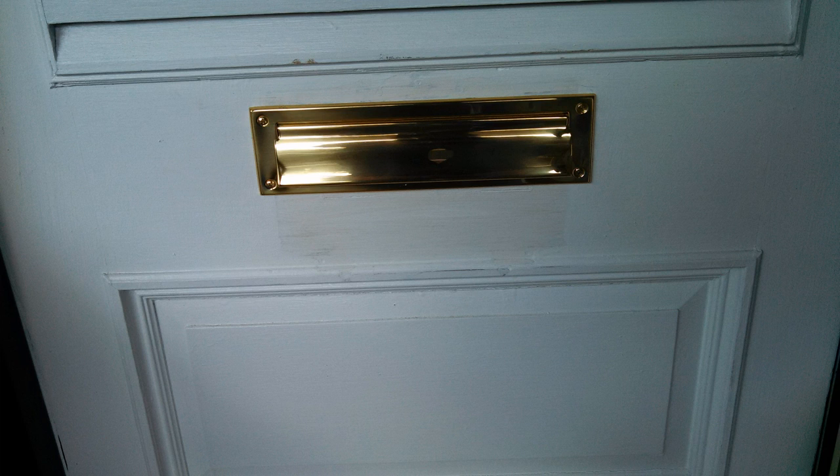Here's an outside shot — it looks really nice. At this point we filled the old holes with wood filler, sanded with 120-grit sandpaper, sanded the old paint lines, and hit it with primer. It looks a thousand percent better. All you need to do is come back a day later once the primer is dry and apply some exterior white paint. If you want to paint the whole door it'll look even better, but at minimum just cover the area where the old paint line shows through the primer.